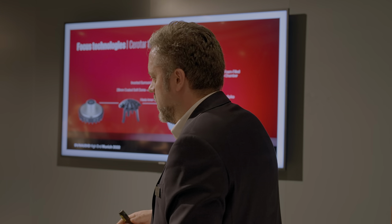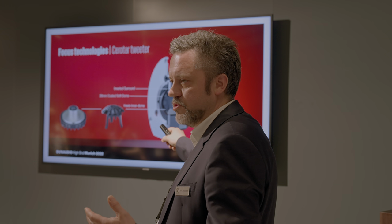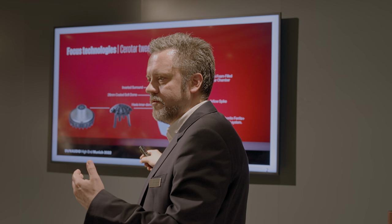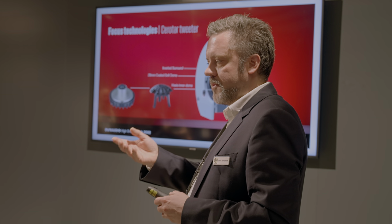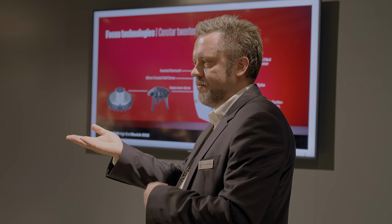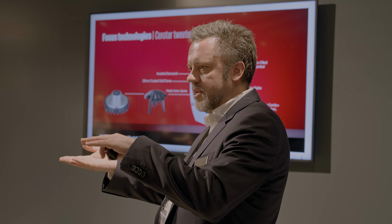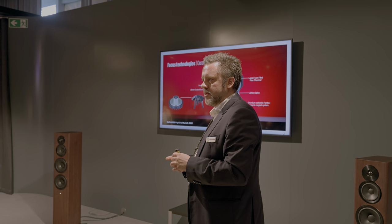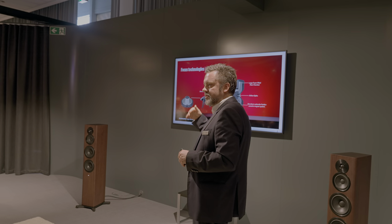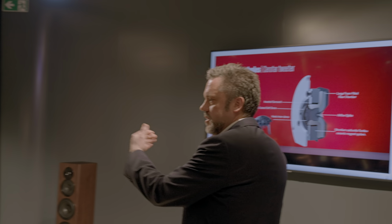One more point about the tweeter: this is a ferrite magnet. On our passive speaker lines in the higher-end models, we use neodymium magnets, which are more powerful with higher sensitivity — good for passive loudspeaker crossover design. With an active speaker, that is not necessarily a good thing. When you raise sensitivity, you also hear noise levels more. And because we have plenty of power here, when the tweeter sensitivity is higher than the woofer's, you have to turn down the tweeter in the amplifier, which turns down maximum volume but keeps noise the same — worsening the signal-to-noise ratio. By using the ferrite version with lower sensitivity, you actually get better sound. Even though in a passive loudspeaker it would be the cheaper driver option, in the active loudspeaker it performs better than the neodymium version.